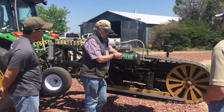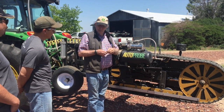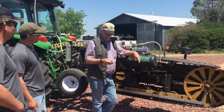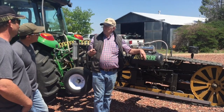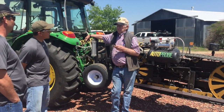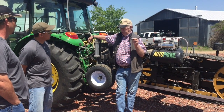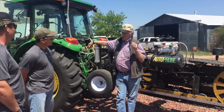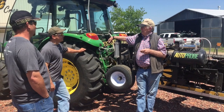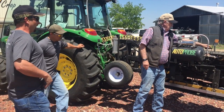Now, that's not to say that you don't hit a rock every now and then and it might chip the tip. This is a hardened probe — all of that probe is hardened. It'll tip a little piece off, which if it's a small piece, it doesn't make any difference. What's probe life? How long does one of those last? It depends on if you're in rocks or not. Most of the time we're not in rocks. These things will last a long, long time — we very rarely ever change one. What are they made out of? It's a special alloy steel — 4130 steel — that is nitride hardened. That whole tube and the tip are both hardened.